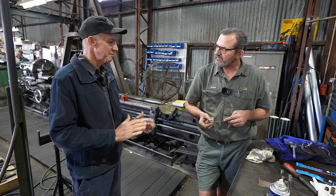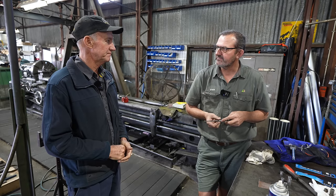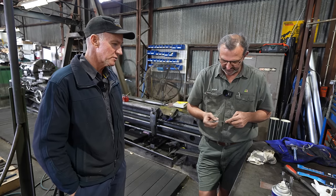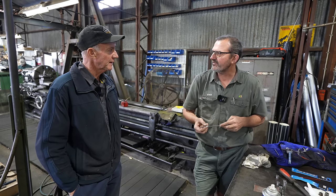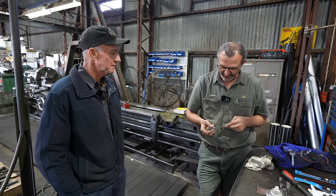If you overcook them, mate, then you start doing damage by hammering pins in. You're going back to starting again, back to square one, with the old dodgy pins you had in there before. The trick to it all is just have that patience. Once it's done, it'll last as long as the age of the vehicle. I mean, them pins are probably originals. Seen a few accidents and miles.